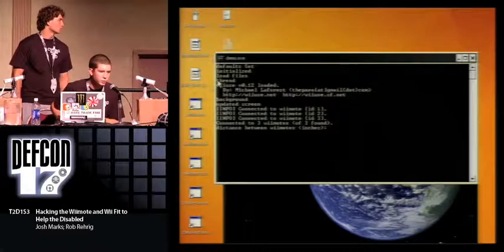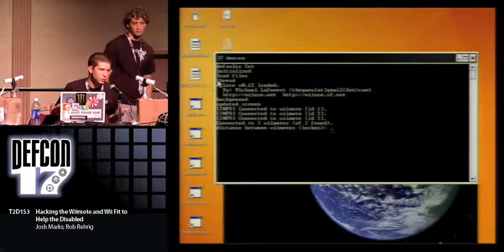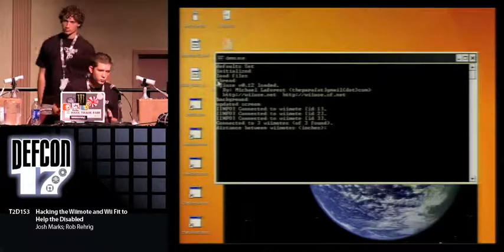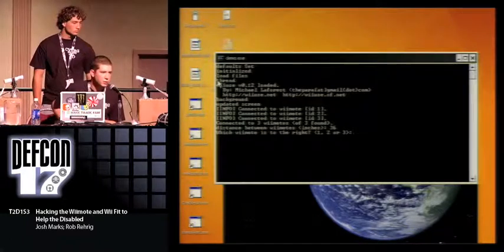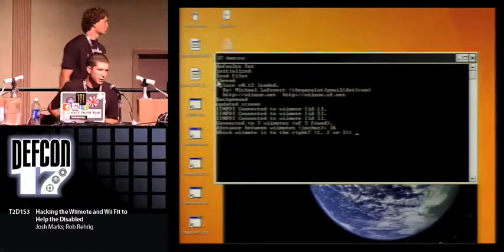All right, first thing I need to do is tell the program what the distance is between our Wiimotes. Currently, we have them at 36 inches apart. It's whatever the user decides, but we found that 36 creates a decent viewable range from both Wiimotes. And then I also have to tell which Wiimote is to the left and which Wiimote is to the right. So first off, I'll say 3, because we have Wiimote 3 to the right,